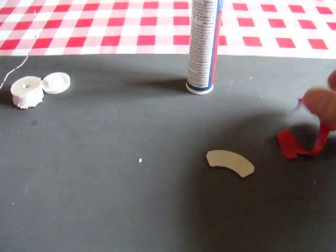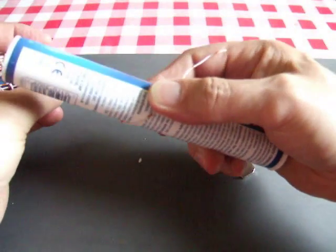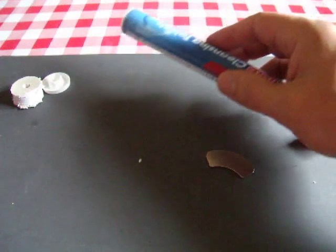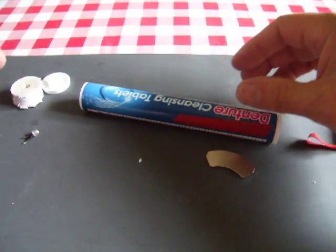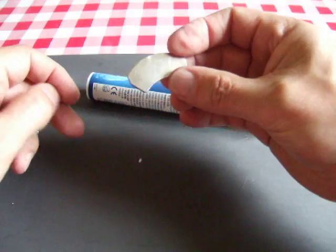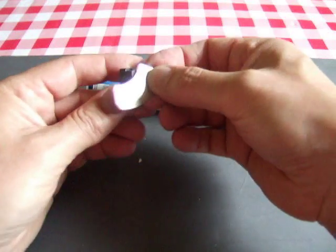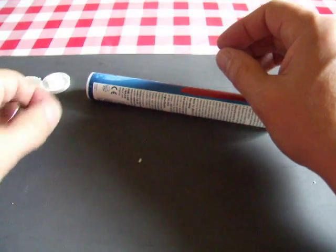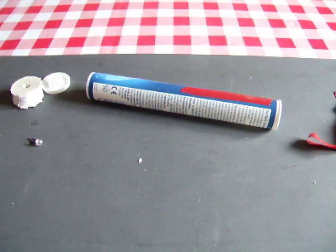So that's the basics. I'm going to wrap the wire around the tube lots of times — I should do that off camera because that will be really boring. Connect the LED to the end of it, stick the magnet inside. I don't know if that will be a good enough magnet, but I've got a couple of little ordinary magnets there — I might add them in as well, see if that increases the magnetism a bit, and then see if we can get the LED to light by shaking it vigorously. I'll wrap the wire around off camera.